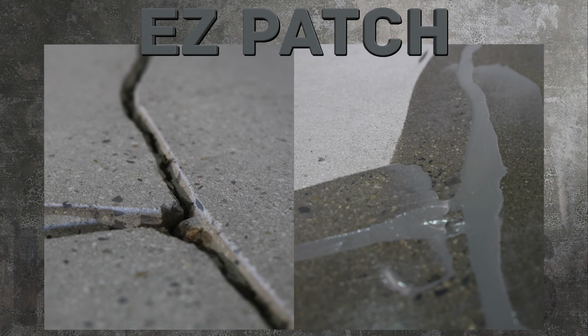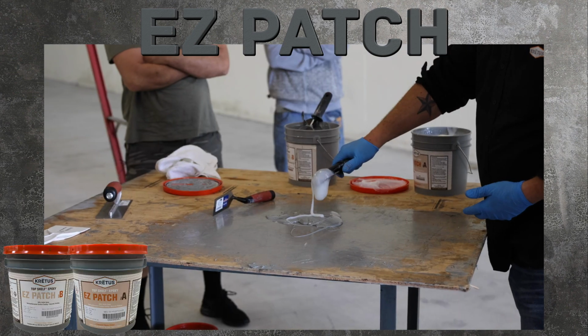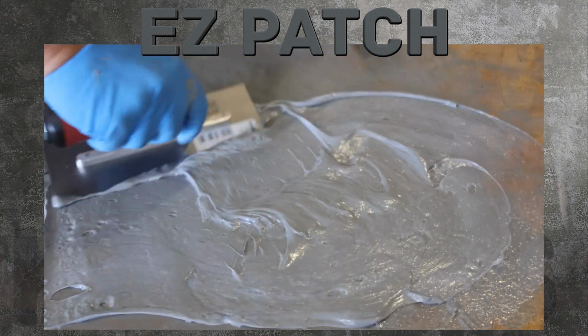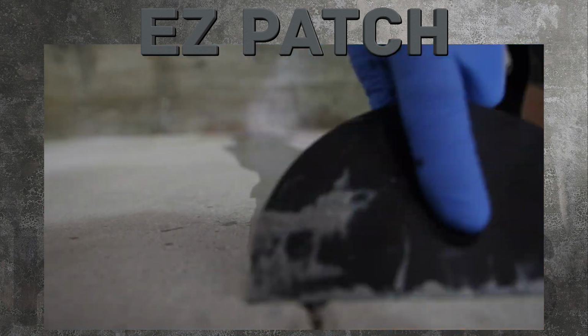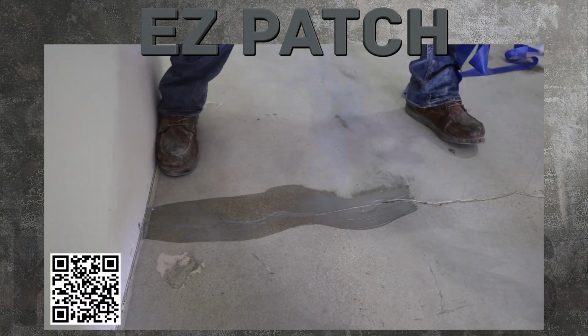Fill the opened cracks with Kretus Top Shelf Epoxy Easy Patch. Blend equal parts A and B. Mix and fold the material on a clean and flat surface until the color is consistent throughout. Follow this link for a more detailed video on this product.